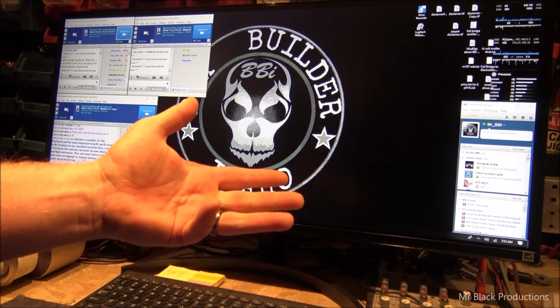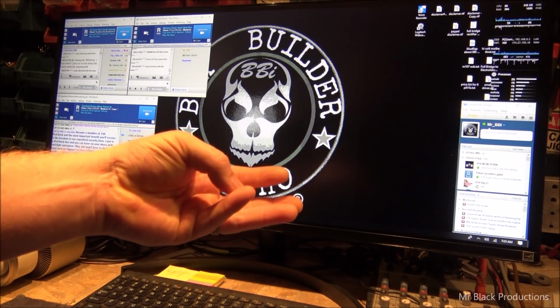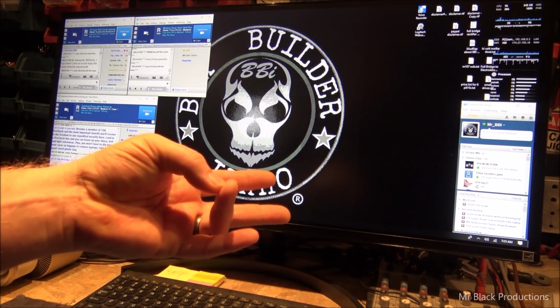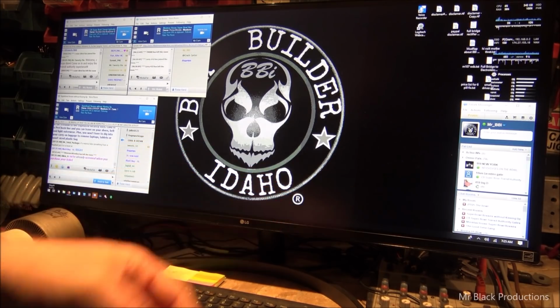That makes sense? And then we tap it out for an 80 amp transformer. So the secondary is going to be 80 amps, but it doesn't matter. As long as we do the 80 amps on the secondary, when we're running it in the lower voltage for the smaller tube, we're going to have 20 amps worth of headroom extra.